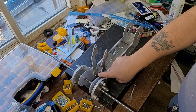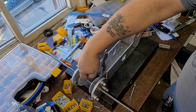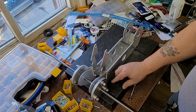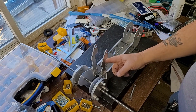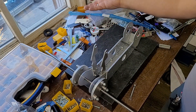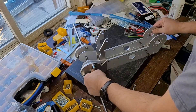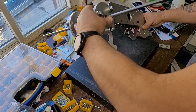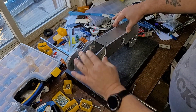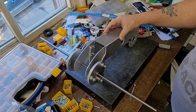By the way, I used a square to align these — align to the back side with the square. You want to keep them perpendicular to the bottom surface. Don't use the front — the front's angled. You have to use the back, and the upper portion of the back is also angled. So I'm going to flip this over quick, just to see — and that is good.